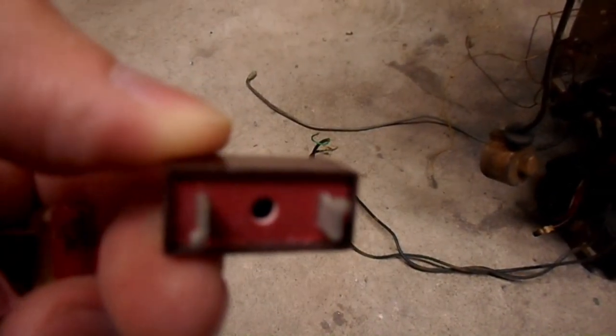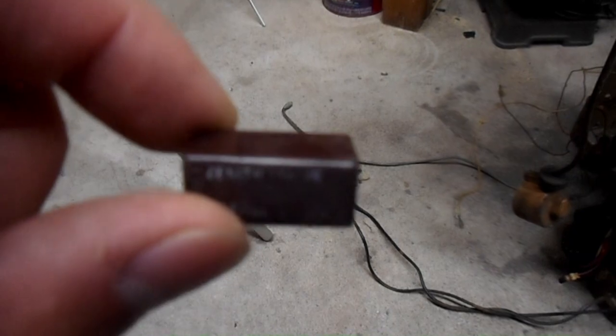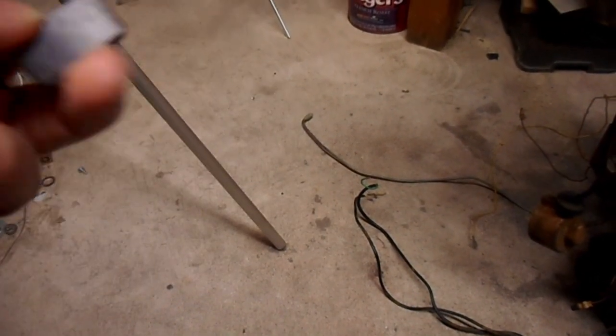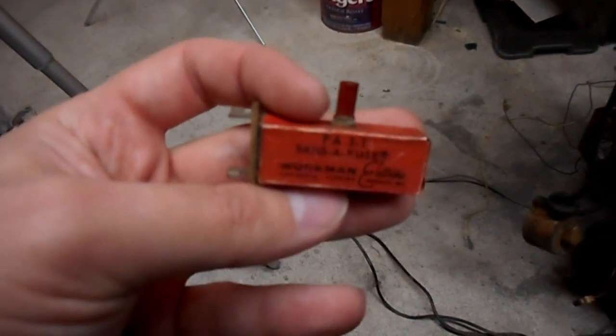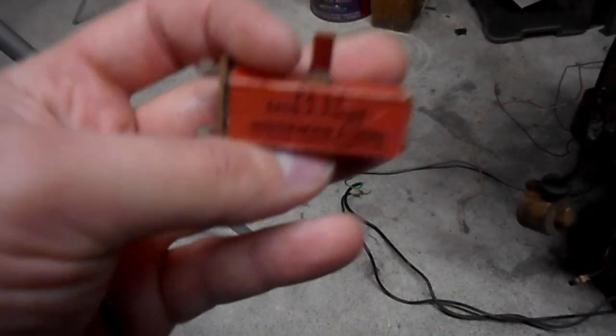On these bell fuses, if the fuse is burnt out, you could pry the plastic off after noting the fuse's amperage and voltage. And you could use the plug-in connector on the bottom of the bell fuse as terminals to connect a circuit breaker with the same rating as what the fuse had, and effectively make your own Workman Sansa fuse if you can't find the correct Workman Sansa fuse, which themselves probably aren't that common anymore.